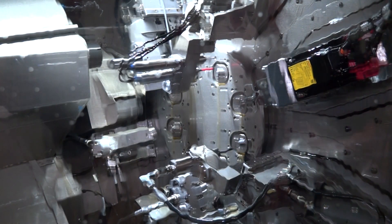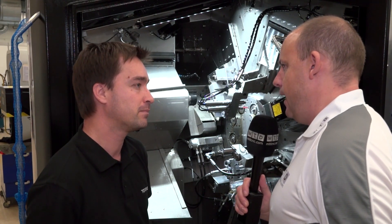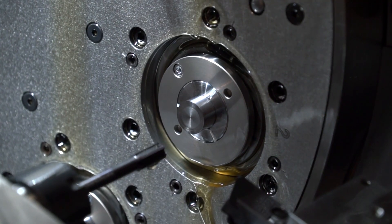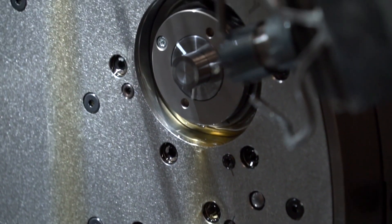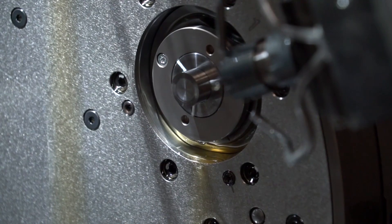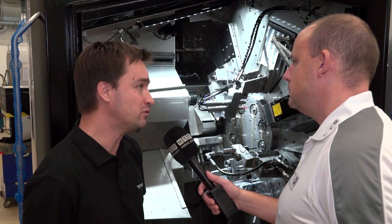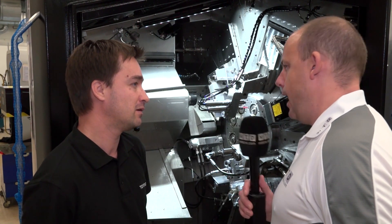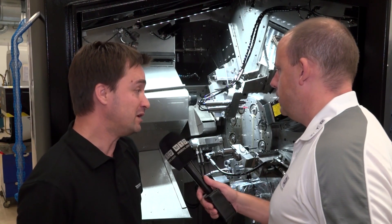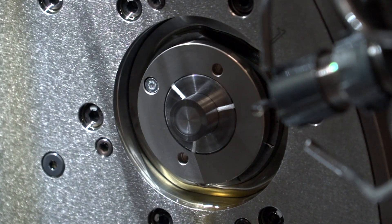What about the spindles — they're quite small, do they have a lot of power and how are they built? On a normal mechanical spindle you use one front bearing and two back bearings, but here on the Multi-Swiss — and it's only on Tornos machines — you will find hydrostatic bearings. What does the hydrostatic give you? It means we remove the front mechanical bearing and have oil instead of the ball.